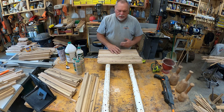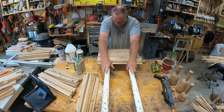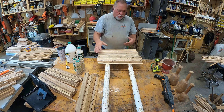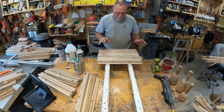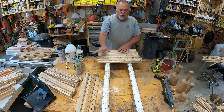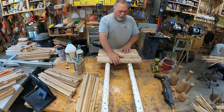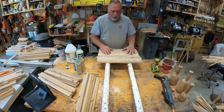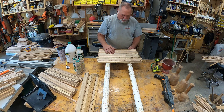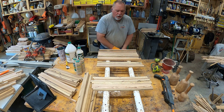It's time to glue up the first boards. I've got my glue-up station here — it's just a couple pieces of inch-and-a-half PVC on a couple of blocks. It makes it easier to clamp up and they really work well, and you can scrape the glue right off them. I'm going to start gluing up the pieces. I don't care that they're not the same height because I'm just going to run these through the planer and this helps save time. I try to cut them within a certain range so they're somewhat close, but making them exact isn't necessary because the planer will handle that regardless.